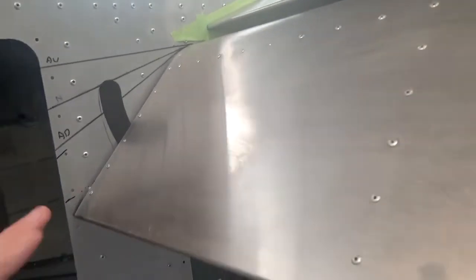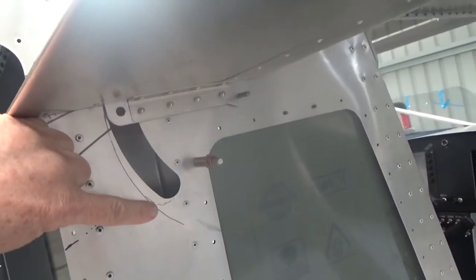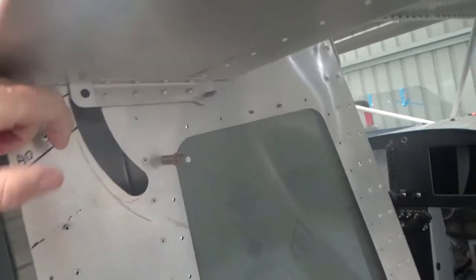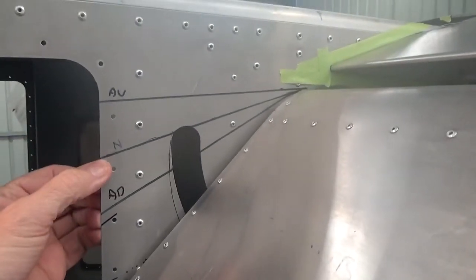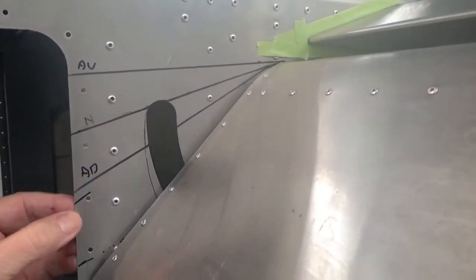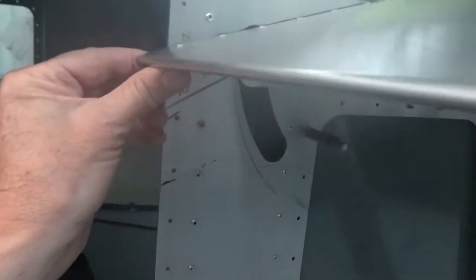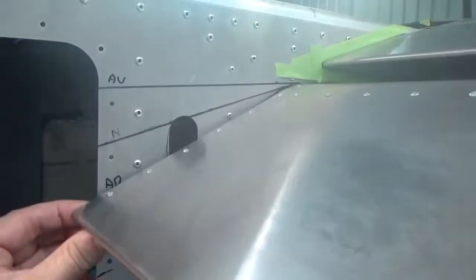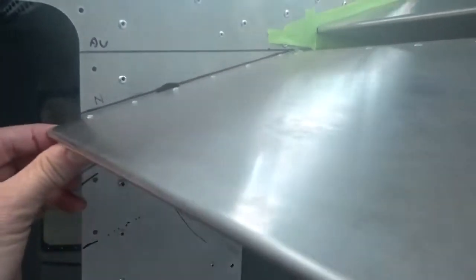I've done a primary sort of rig before I paint the aircraft. Contacted the factory. The first thing to note is the banana slot — on my aircraft anyway — I need to take it back out to here, so enlarged at the bottom. I've set up neutral, aileron up, aileron down. The flaps travel a further two degrees down from full aileron deflection. So from neutral: aileron up, aileron down. And from neutral, full flap is 15 degrees. Check your plans.